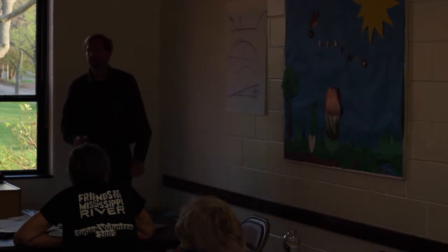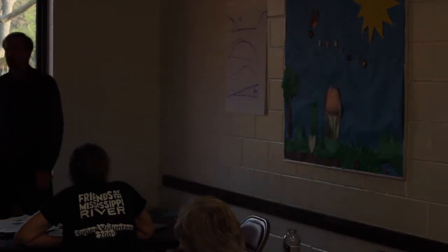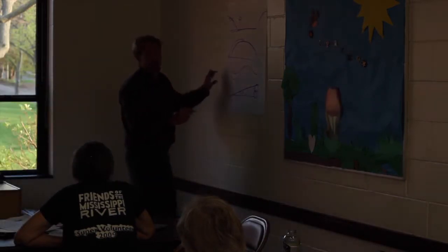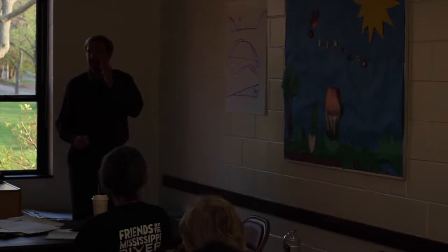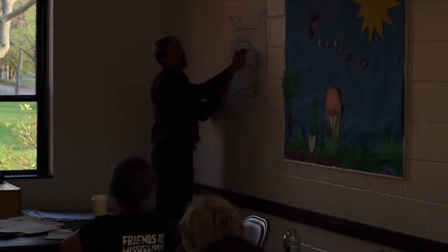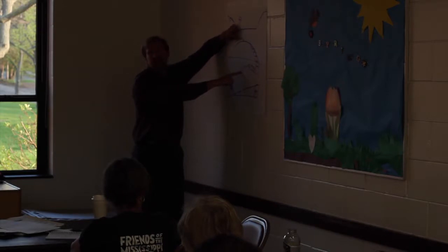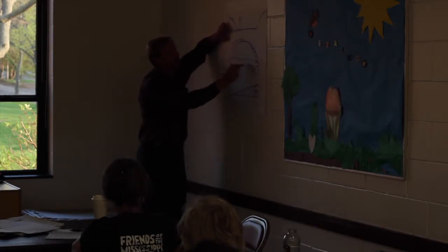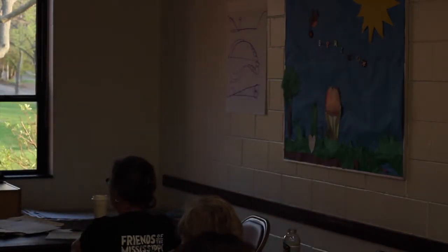Okay. Now, in reality, looking above, your dam might go something like that, okay? I want this spot, or both of them, to be the lowest spot along the outside edge. And that's your outlet. So then you have your boulder wall right there. Okay, you see, and so that makes a little more sense. Now, these two spots are the same, but these spots are higher in elevation by an inch or two than this spot. So that when the water fills up, it goes out this way around your dam, not over the dam. Got it? Make total sense?